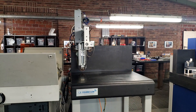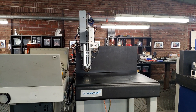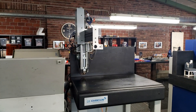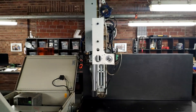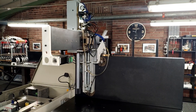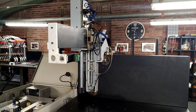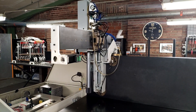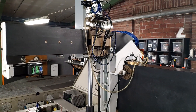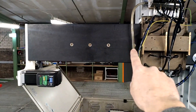I'm quite happy with the placement of the ball screws and the servos on the Z and X axis. Where I'm not happy is the Y-axis. I've been playing around with at least six different versions of this. It's always a very different thing to build a machine from scratch — where you can decide on everything — than to retrofit an already existing machine. In this case it's even more difficult because the only bolt holes you have are M4.